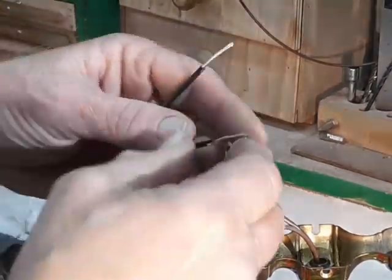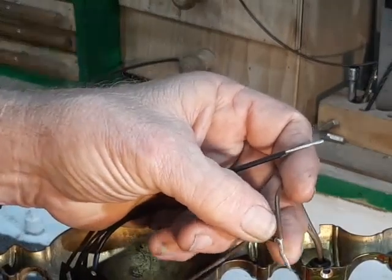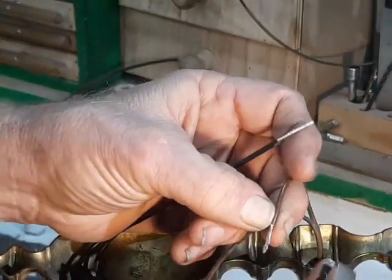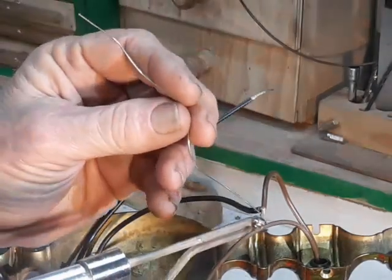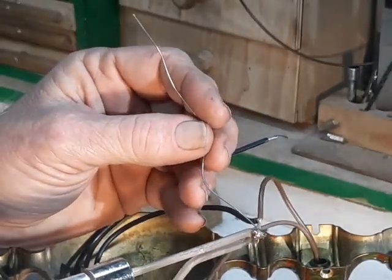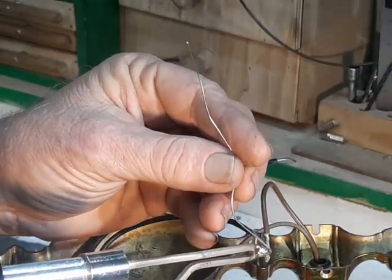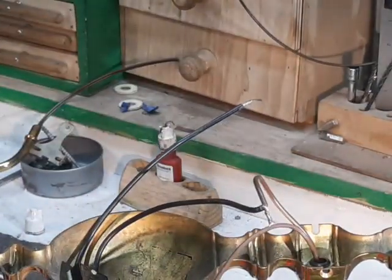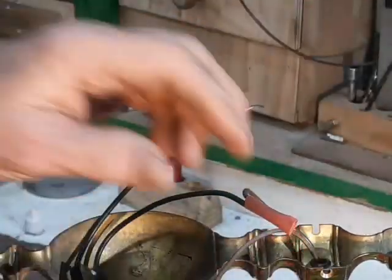All connections in the Secret Underground Laboratory are soldered. I don't use wire nuts, and I certainly don't just twist the wires together and cover them with tape. After the solder joint is made, clip it off nice and clean, and then cover it with a piece of shrink tubing — a peculiar kind of plastic that, as the name implies, shrinks when it gets hot. Then I fold it over and put another piece over the end of it just for a little extra protection.